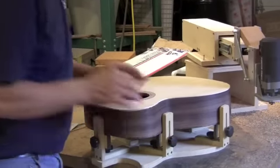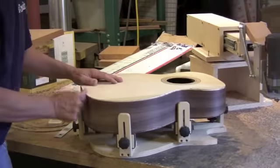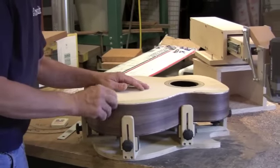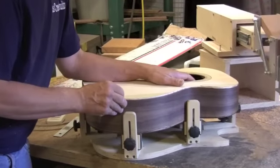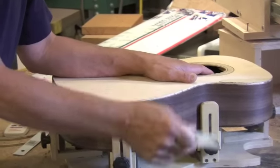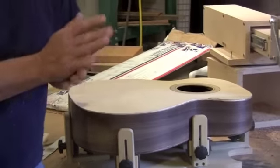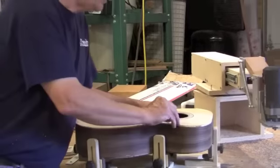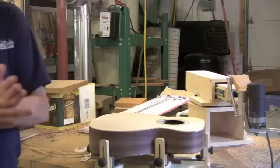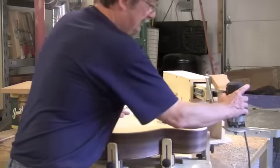And I don't just grab it and rip. Here we're going to have to go the other way — I have a little bit of fiber here and more up here, so my run out is showing that way. This is actually a pretty decent piece of wood and the run out is not too severe. Another big advantage to having this tape on here: if you do happen to have a piece that wants to break off, you can find the piece of tape and find the piece where it broke out, so that you can have the piece back to repair it.